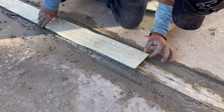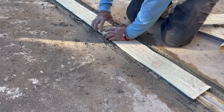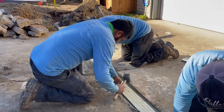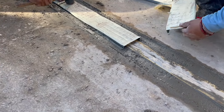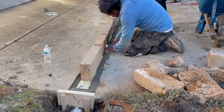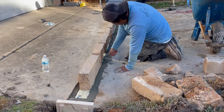All we're doing is putting the grates directly on the two by fours. The thing we have to watch for is that the concrete while it's wet can lift the two by fours, so we'll just be putting something heavy on there — like the removed concrete — to keep it weighted down. The last thing you want is those grates to be above the level of the finish side. Just putting the finishing touches, and we'll let it dry, pull the forms, and we're good to go.